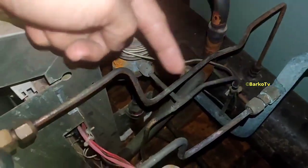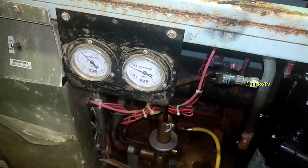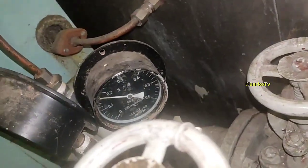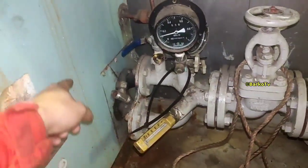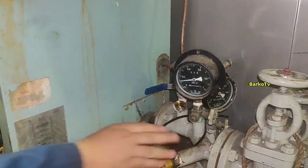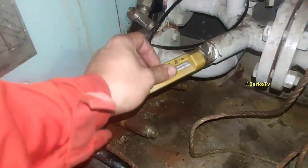As I've noticed, the condenser — or the discharge pressure — is starting to rise up. Checking the cooling system: there is a pressure drop. The inlet is 1.8 bars and the outlet is 1 bar. There may be a plug on the condenser. The temperature is almost 38°C.